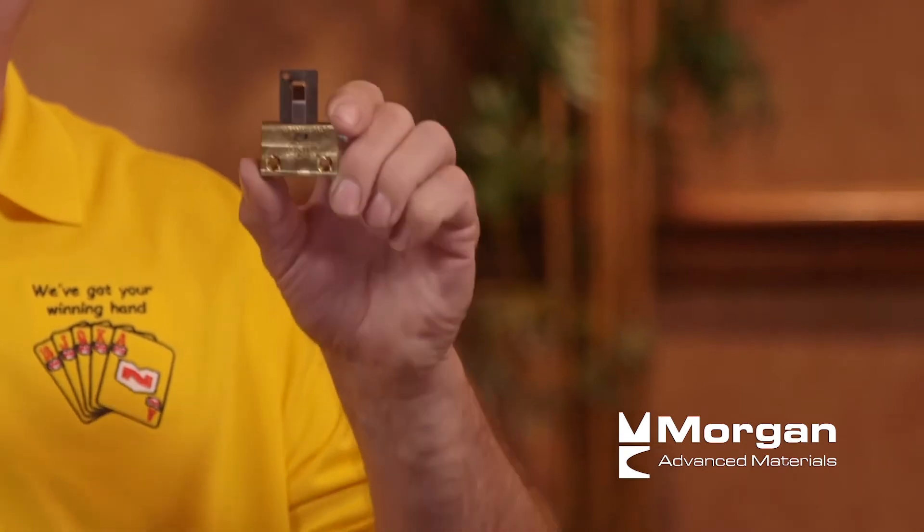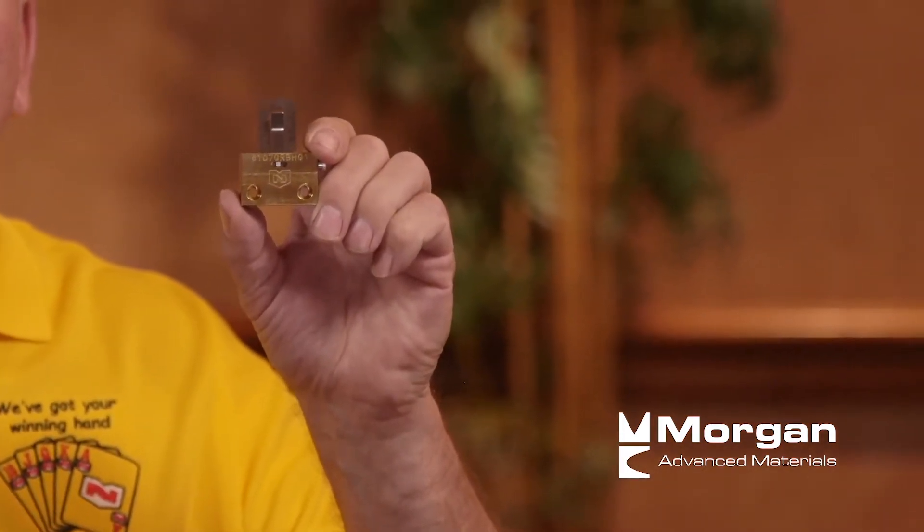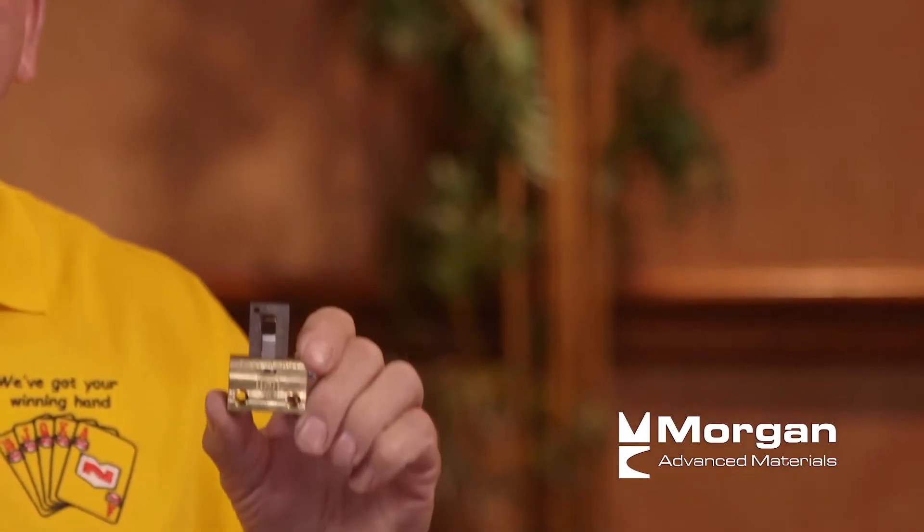Due to the size and weight, I did not bring a slip ring here today, but I do have a couple examples of our brush holders. First, I have a shaft grounding assembly that uses a silver graphite brush for the lowest contact drop. We have a few different sizes of mounting styles to match existing configurations, or we have an adhesive system where accessibility limits drilling and tapping holes.